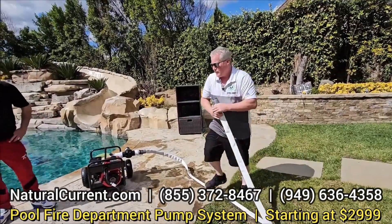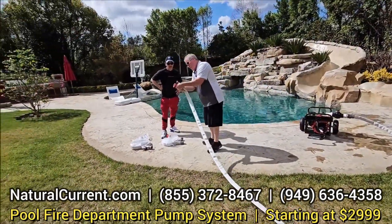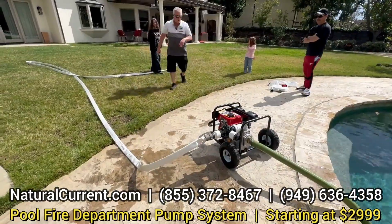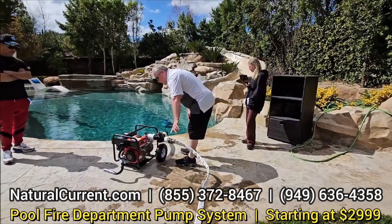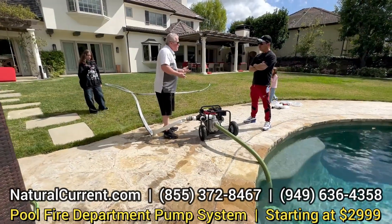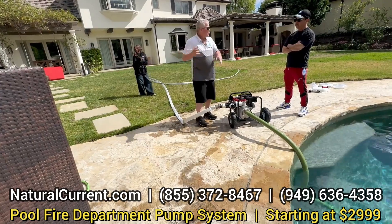It'll be working great. Now on the other end, you want to go ahead and put a nozzle on. So now this is on, and you can see on here where it says open to the left, close to the right. So you have a close, but then you just kind of crack it just a hair, just so a little air can come out when you fire it up — that's what I recommend. So now we have the suction line in, we have our return line with the fire hose, now we're going to fire it up. So when you're going to start this motor, it's been sitting and it allows you to go ahead and use the choke, because it hasn't been started in a couple days or quite some time. And then when you fire it up, it's going to have like a generator sound noise to it. Make sure we're all ready for that.